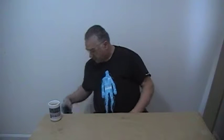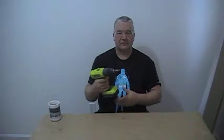For this project, I used several tools to cut and drill wood and other materials. When using tools of any type, you should always make sure that you understand how to use the tools safely. Here I have safety glasses, which help protect my eyes when I'm using things like drills and saws. Some tools, such as this battery-powered screwdriver, can also be used with a drill. For instance, when you're drilling, always put a piece of scrap material underneath the object so that when the drill goes through, it doesn't ruin your table surface.